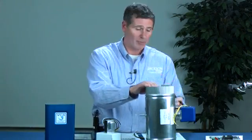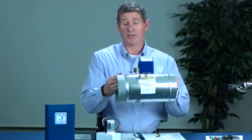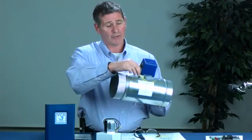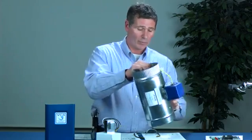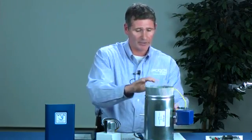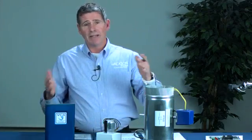The first thing you're going to notice is the damper — it's a 6-inch damper, looks pretty much like any other damper, and it's a 2-wire. The configuration it comes in is a power open spring close type, which is a little different than the normal damper where they're typically power close spring open. The reason we do that is so in the middle of wintertime, if the Fresh Air Ventilation System is in operation and you have a power failure, the damper will go ahead and close. That way you're not bringing really cold 30-degree-or-less air into the house.